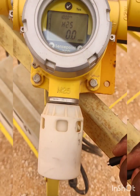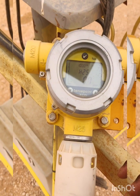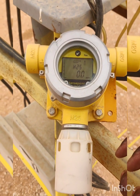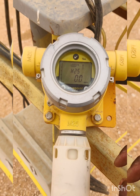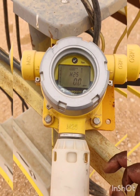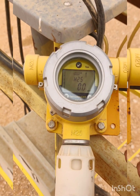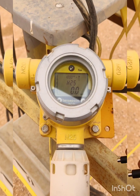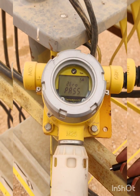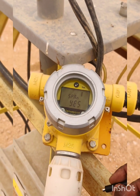We will now do the calibration. Select 'Set Cal' and press OK — it goes directly into zero calibration mode. For zero calibration, the sensor will sense the atmospheric air and automatically detect the range. Once it reads zero-zero, we wait a few seconds for a stable result.